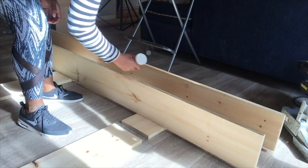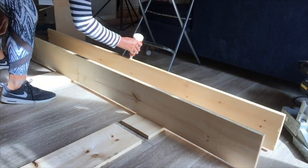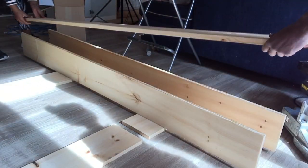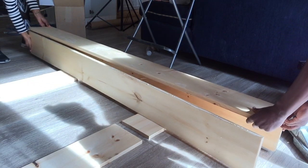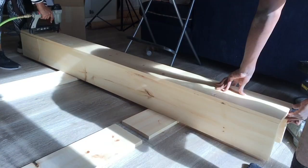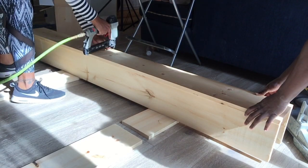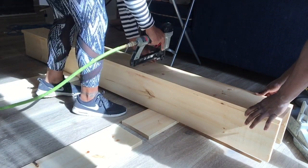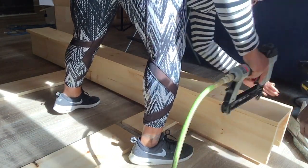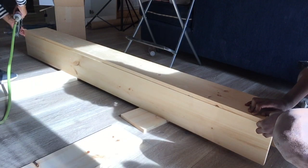You're going to adhere the wood glue to the edges of your two 2x8s. Roy was being my little helper that day of course. Then you're going to take the third 2x8 and lay it on top — you're definitely going to need assistance to do this, it's a lot easier with some help. Use finishing nails and a hammer, or to make it easier use a nail gun to secure the third board to the other two boards.